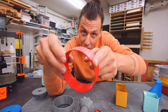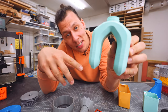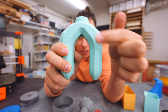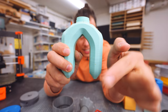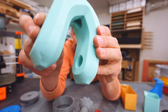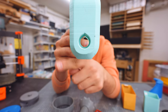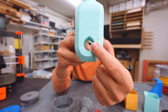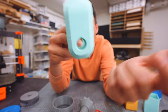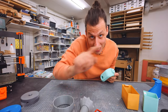If you want to add a fillet on the top of a part, that's totally fine — I do that all the time. Here's the front fork for my scooter as a good example of using chamfers instead of fillets. The top is basically two chamfers instead of a fillet, so this thing printed without supports and the print quality is pretty good. Same goes for the sides — chamfers instead of rounded fillets — and even the holes on top are chamfers. On the bottom of a part, always use a chamfer, never a fillet.